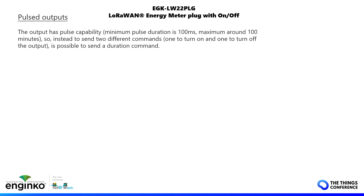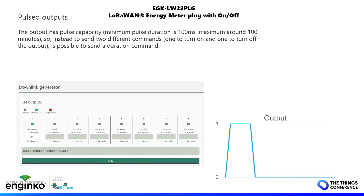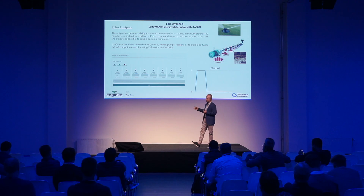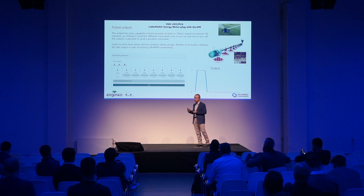The output can be driven with a duration. That means if you want to drive a valve, a motor, or something similar, you can send a message specifying the duration of the output. You can also implement a watchdog or safe-state output in case of a problem. For example, if you drive a heater — a quite dangerous load — you can send a message with an on-time of 30 minutes. If you send another on-time command before it expires, the heater stays on; but if you lose the network connection, in the worst case the load will go to a safe state after 30 minutes. You can set the duration from 100 milliseconds to 2 hours.